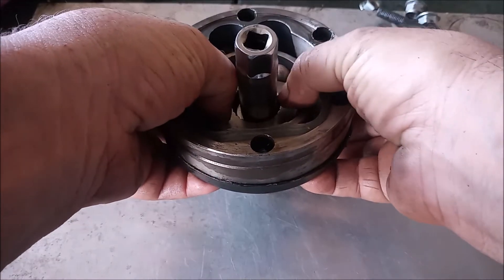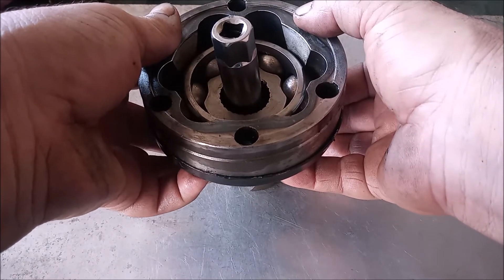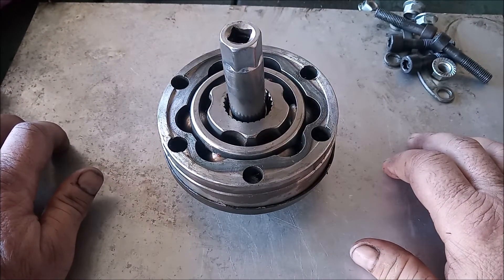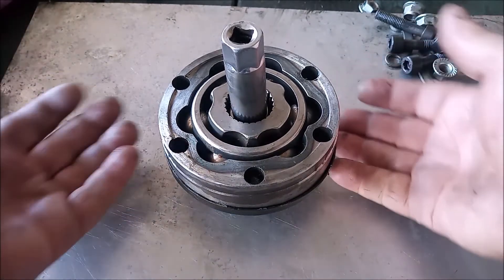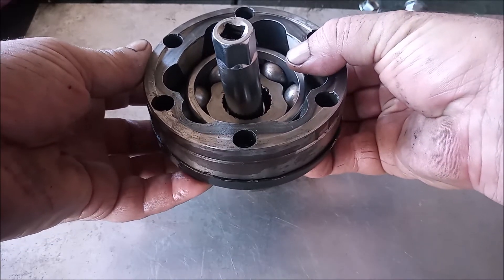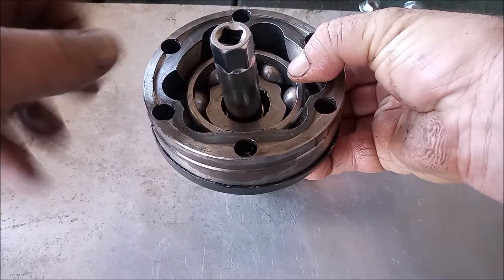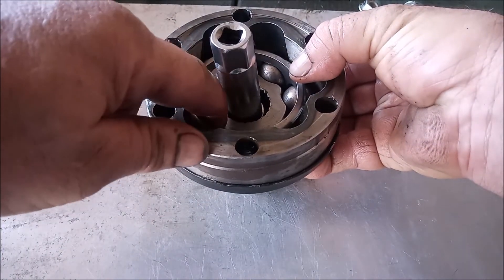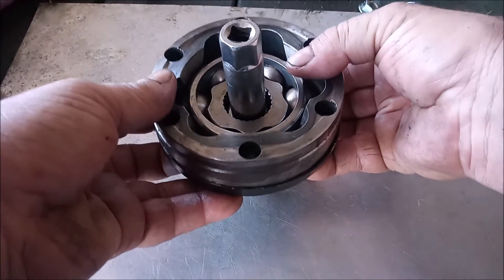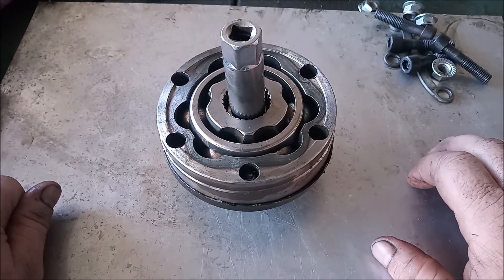At that point, if you are able to support the inner cage, the balls can slip into the grooves, and you can just move the parts relative to each other so that everything comes together. So the idea is you start from the top with no balls installed, line up the bottom surface of the outer race at the same level as the top surface of the inner race, the cage floats in between, and then you drop the balls in one by one. Each ball falls into its groove until you have all six ball bearings installed in their grooves, just like this.